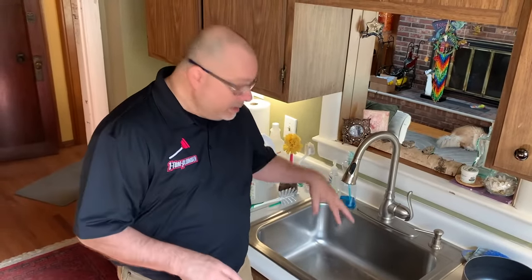So I've shown you five different solutions for deodorizing and sanitizing your kitchen, bath, or laundry drain if you have smelly odors coming out of it. One thing to keep in mind: if the odor isn't coming from just one drain but from multiple drains, you may have a problem with your water heater's anode rod — we have another video on that. Most of the time, if it's just one drain, you just have a sanitation problem with bacteria and biofilm causing the smell.